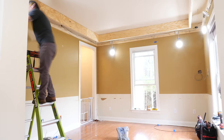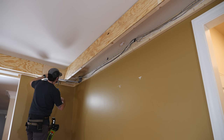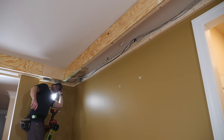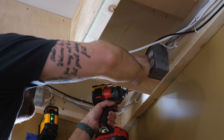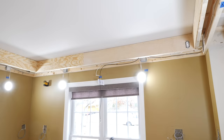This is how the room looked with all the wiring in — here are the cables coming out of the wall at the front of the room, all labeled. With the wiring done, I could finish up the framing with some more 2x4 stretchers across the bottom of the soffit. These stretchers ensure the vertical soffit faces are plumb and lock the pieces in place before adding the horizontal sheathing on the underside. I set the line laser so it would land between the plywood and the 2x2 when the soffit was plumb, cut my 2x4 stretchers to fit, and worked my way around the room adding blocking every 2 to 3 feet, leaving space around the recessed lighting and in-ceiling speakers.